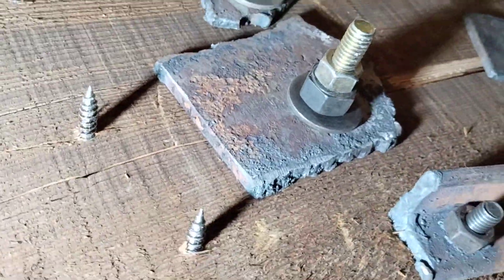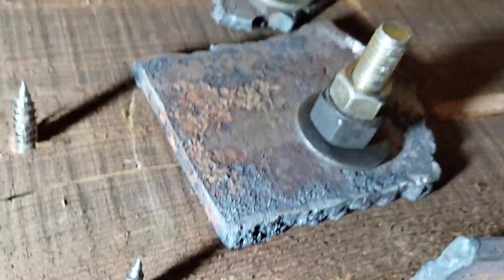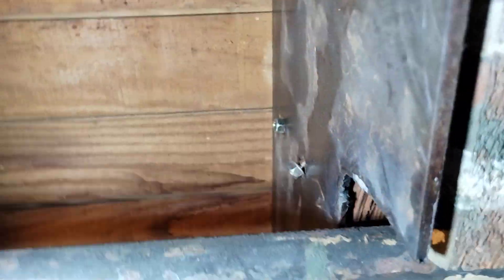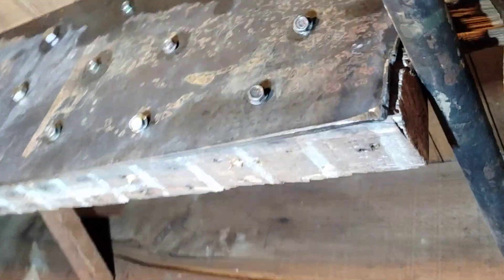Those little cuts dig in pretty nice - wait for it, don't be impatient. They're all in there. The screws here stop the middle of the steel - this is cut around this pipe - it stops it from buckling, torsion buckling. That's what the screws are for.